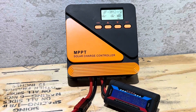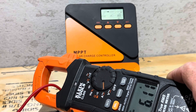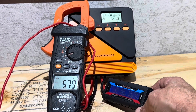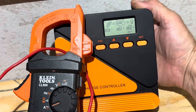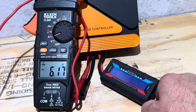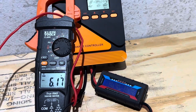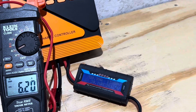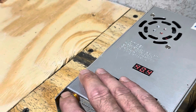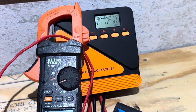Showing our PV input at 49.2 volts, and 5.8 to 5.9 amps. On the clamp meter on the PV input side, it's reading 6.1 amps. It's putting in almost 300 watts at 21 amps — I've got it maxed out. Everything's working, it's still cold to the touch. Internal temperature has come up just a smidge, all wires are cool. I pushed it over its amperage for several minutes now, still pushing close to 300 watts going in at times when it's tracking. Now I'm going to turn the voltage down to about 40 volts and see how it tracks there. It detected the new voltage and it's re-tracking just like it should.